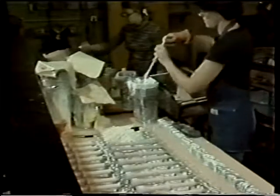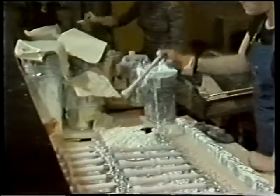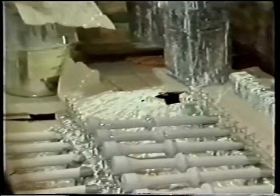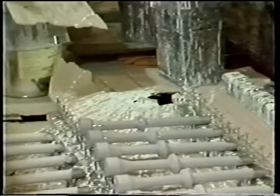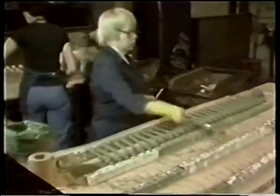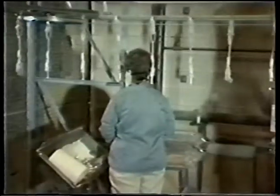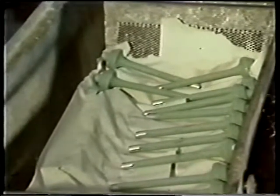It was mentioned earlier that ceramic silicone coating is applied between major operations. These in-process parts have been extruded and upset. They are now dipped in ceramic material prior to block forge. Different coatings are used depending on part material and the forging process to be done. Some parts lend themselves to electrostatic spraying of the coating. This machine automatically turns and sprays coating material on parts, resulting in even and complete coverage. Coated parts are now ready for block forge.